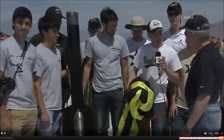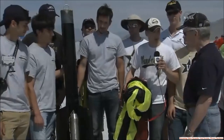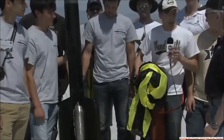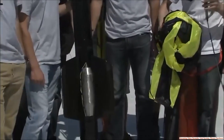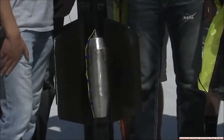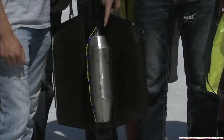So the liquid fuel management system had a small aluminum fuel tank on board with liquid fuel inside. Inside that fuel tank there was a series of baffles to abate the slosh. After main engine cut-off, the fuel wants to slosh around, so we want to prevent that so we can deliver fuel to the ramjet engine. The ramjet is the second payload on our rocket.